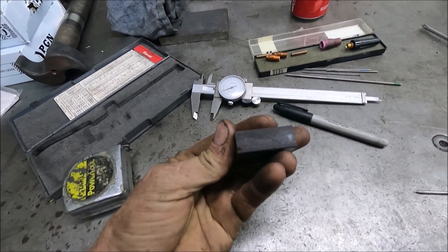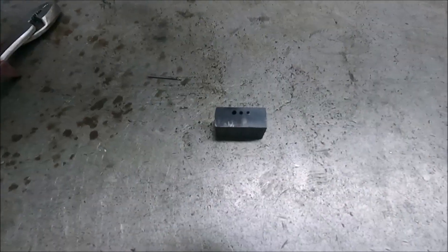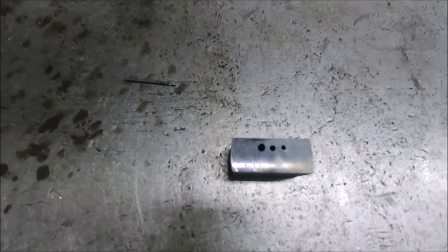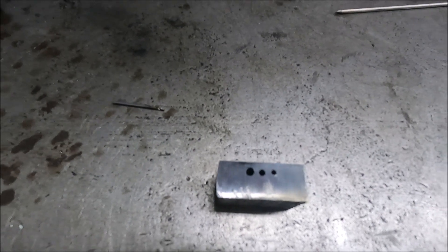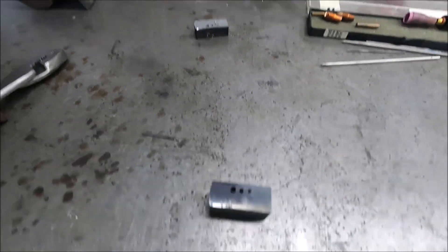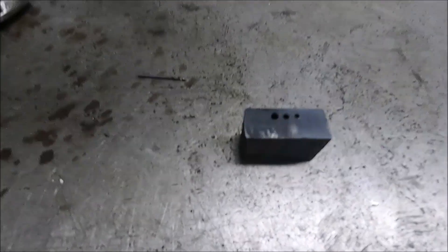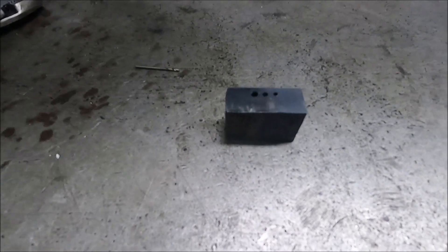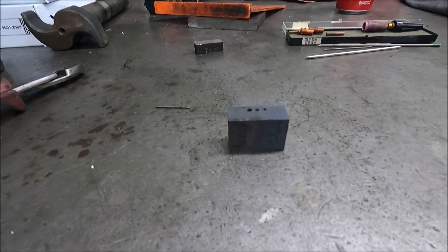I got enough so it's thick enough to drill through it like that. This wasn't real easy to drill. The smallest hole — I broke a drill bit off in it, but I was planning on cutting a little bit off of it anyway, so I cut that piece off. I stuck this in the vise, heated it up red hot, stuck something in from the other side, and was able to knock that broken drill bit out. It's very hard to drill that small if it's tall because it's real tiny.